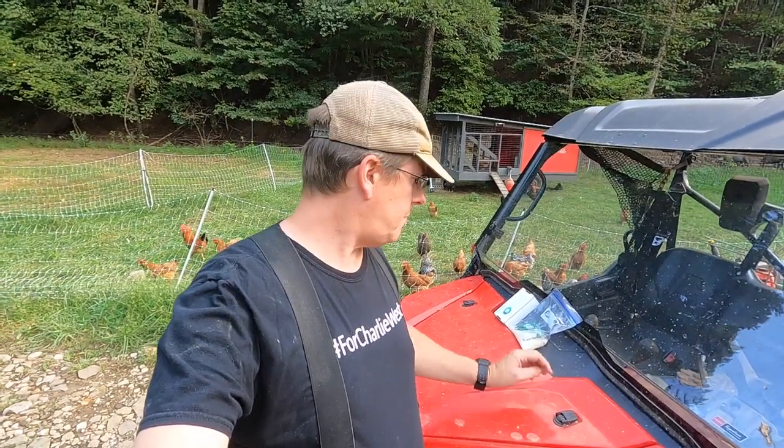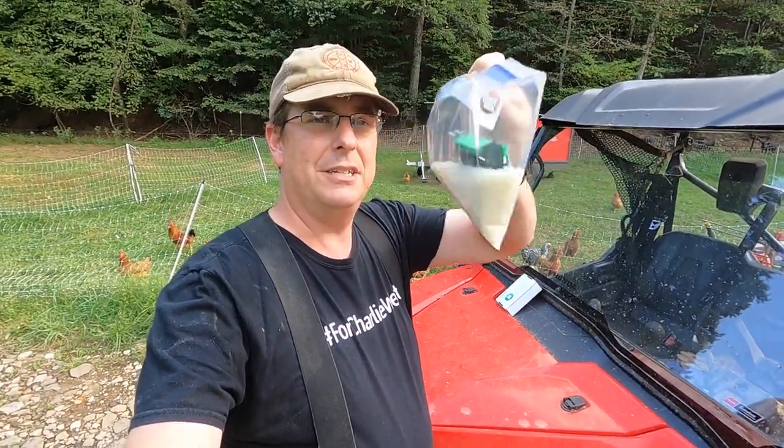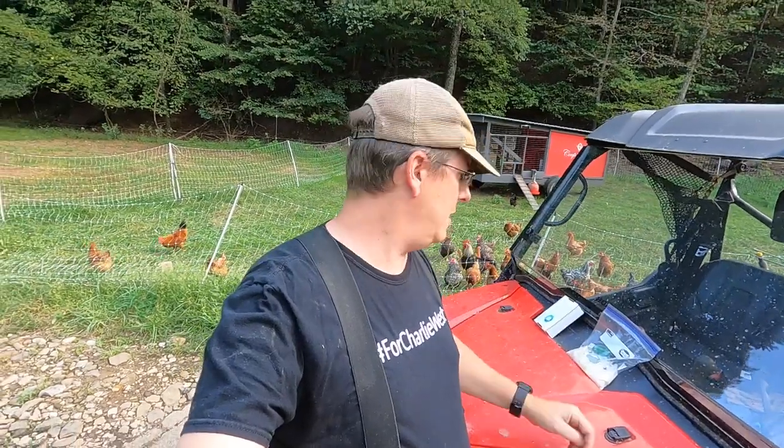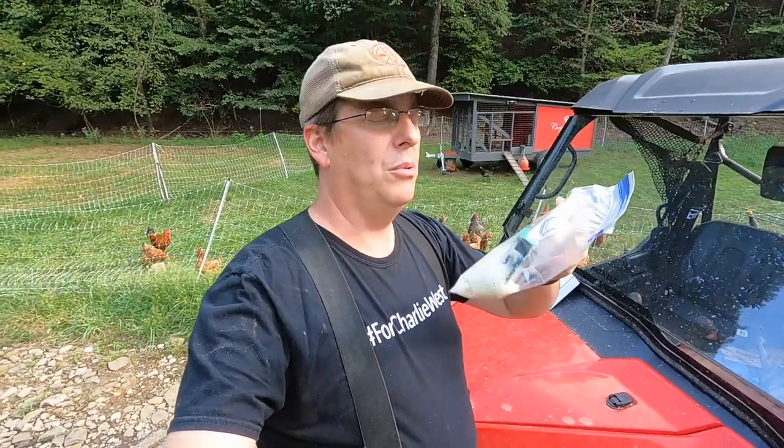To say that we've had some extreme weather this summer would be an understatement. Some of you guys even commented about one of my design flaws, and being the hard-headed guy, I didn't listen. But now I'm listening. What I hold in my hand in this bag of rice is charge controller number two of our solar charging system. Even though it's in the battery box, when we'd have these heavy downpours it would still splash enough water in there. I drilled holes in the battery box so it would drain out through the bottom, but it just splashed enough water in there to get into the charge controller and turn it into crispy chicken. Put it in the rice, but you could look at the board and tell it was smoked. So I had to wait a week to order a replacement. This is my third charge controller. Fortunately these things are only about 20 bucks, but 20 bucks times three is still adding up.